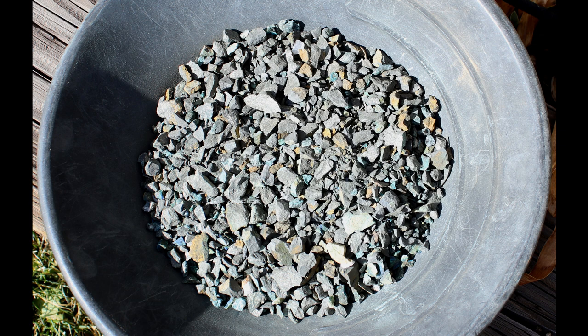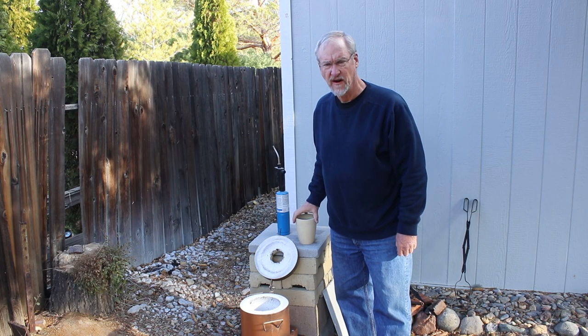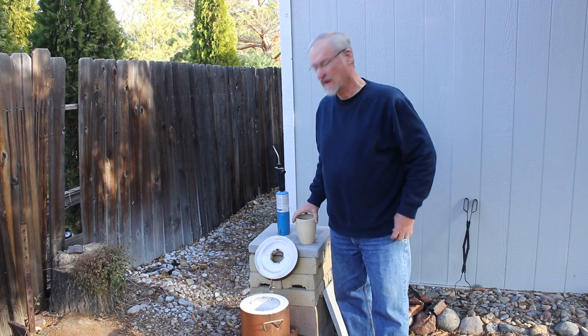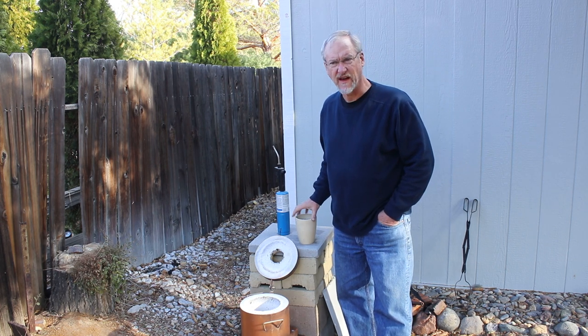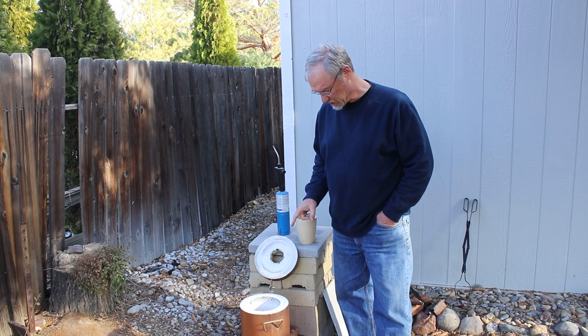So I'm going to take this material and I will mix it with some borax and some sodium carbonate. These are standard fluxes, and I'll use that for better melting and better liquefaction of the whole mix. So I've got that crucible here, the sulfide mixture with steel at the bottom, and lots of flux in there. I even put some glass, broken glass, on top. So I've got that mixture here. It's all ready to go. I'm going to put it in the furnace.